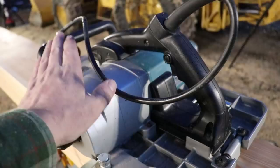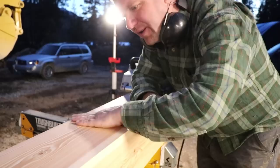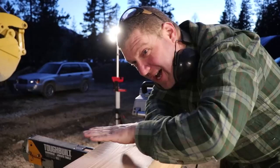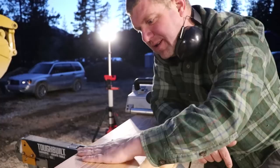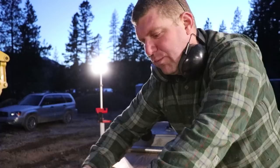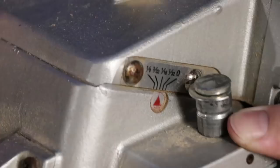Are you ready for a rotate-a-roo? Not yet — see this spot right here, it's still a little rough. Would you say hit it again? What did you take off, like a 16th? Between a 16th and a 32nd. You can try a 32nd. But in the end you have to decide: thickness versus finish. Or you can always rotate that to the inside or outside where it won't be visible. One of these faces we could not even plane because it's going to go against the house. We're not under a time crunch — that gives us discretion. I think I want to take one more pass. I want it to look really good.